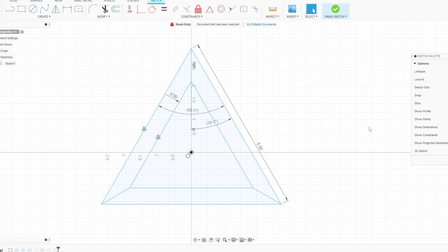I wanted to go more in depth on how I'm going to cut these angles. So as you can see with the equilateral triangle, you have 60-degree corners here, 60 here, here, and here. Now, when you miter them, you're halving that angle. So the miter cut that I need per piece is a 30-degree angle, and I'll have six of those cuts.